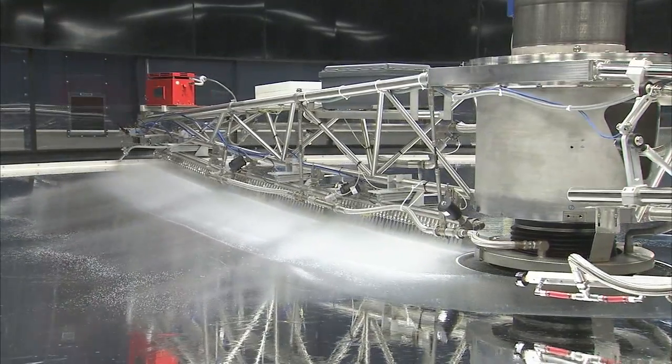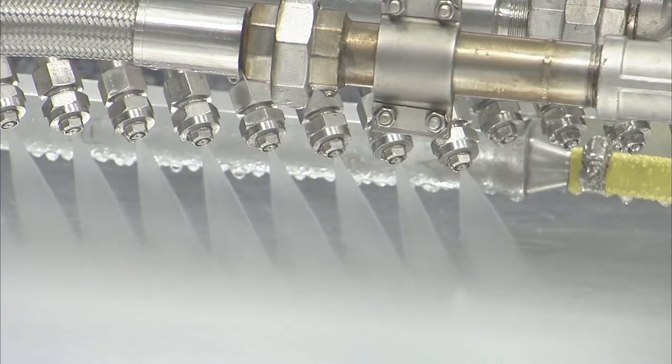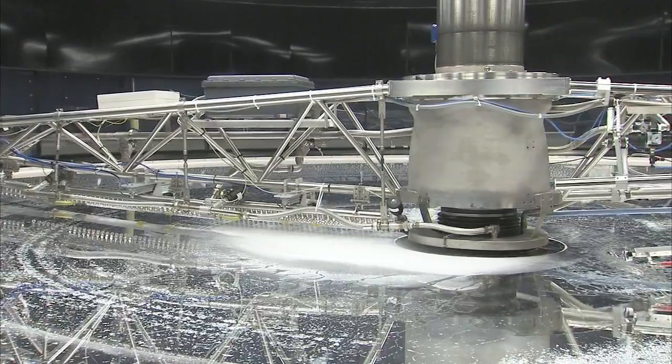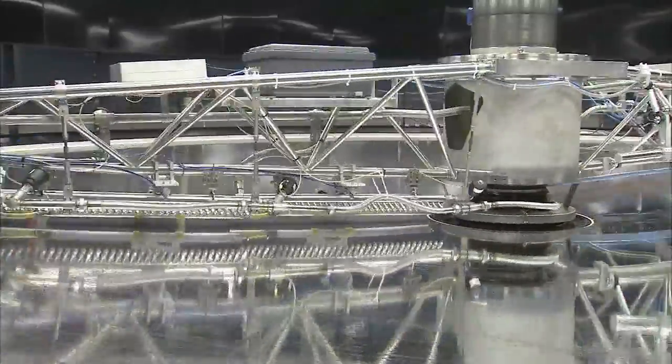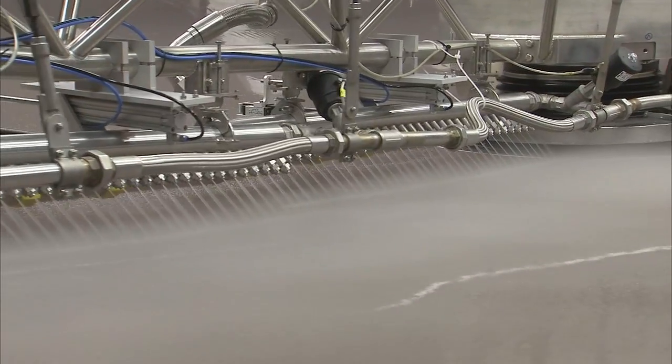The washing process begins and a giant purpose-built sprayer arm rotates just above the surface of the mirror. Ultra-pure water and chemicals are used. Under the critical eye of the optical engineers, the machinery does a flawless job and the operation proceeds smoothly. In the next stage, acid is used to remove the old aluminium coating. The real amber colour of the dish appears. The mirror is made of special ceramics that don't deform under temperature changes. Again, the mirror is rinsed intensively to provide as clean a surface as possible. Once done, all the liquid is pumped out and the mirror is ready for the vacuum chamber.